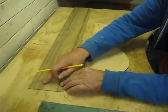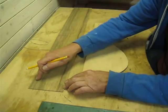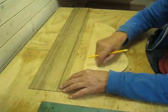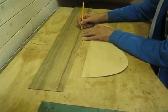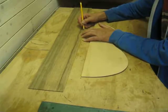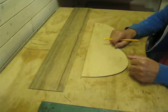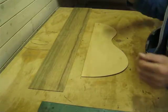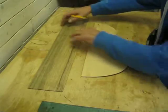So now I know the height, I know the middle. The higher side I put across. So I know, oh yeah, higher side. I do it on the other side as well. Over here, where the waist mark is, I'll make an arrow down. Reminds me in bending, oh yeah, that's the side that's going down. Comes in handy when you're bending and you don't have to puzzle your mind what was the biggest side or which way was down. It's easier.